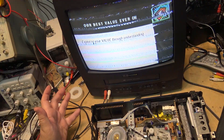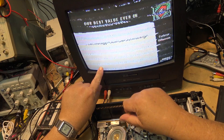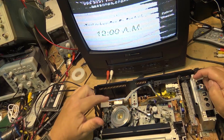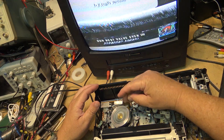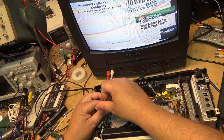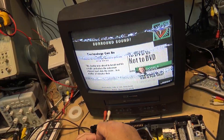Okay, really bad. I want to try and get this close. I can start on either the top or the bottom — this time I'll start on the bottom side. I'm trying to improve the picture and get the least number of noise lines as I go down. I watch the tape: if it starts to curl on the bottom of the guide, I know I'm too low. I'll bring the tape up by turning the guide until the tape is no longer curling. That looks fairly close. Now go to the other side, adjusting that guide and watching the lines in the picture — they'll get further apart as I get closer to correct.